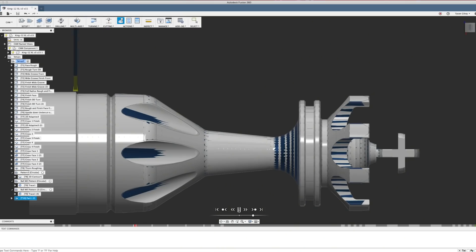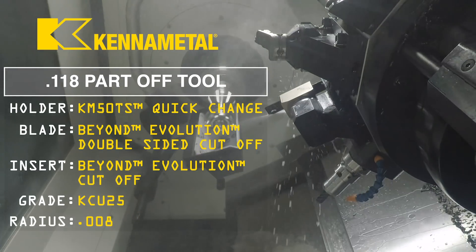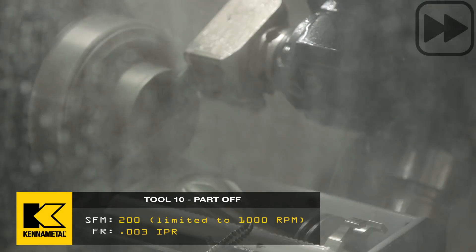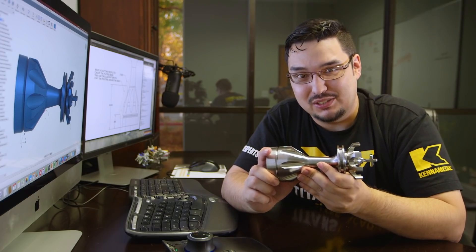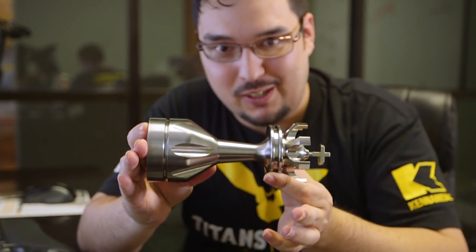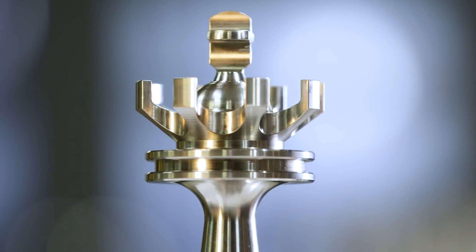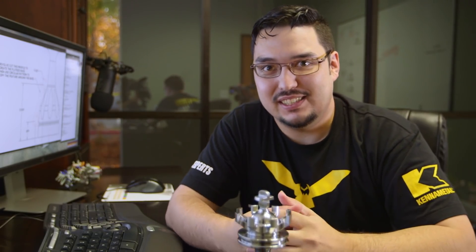Now the whole part is done and we just need to part it off. Tool number 10 is our 118 thousandths part-off tool. We just go straight down at 200 SFM, limiting the RPM to 1,000 so the part doesn't go flying, with a feed rate of 3 thousandths per revolution. The part's pretty big and heavy so it's a little sketchy using the part catcher, but it was just the right size — almost like it was made to be. So there you go — you know how to machine this part now. You used some crazy live tooling that you can apply to pretty much any part. As I said, the operations in this part you can use on aerospace parts. Thanks for watching — make sure you check out my other lathe videos and I'll see you next time.